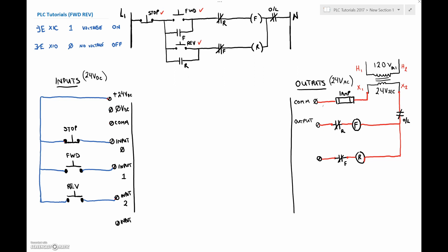I've made a list of all my inputs and outputs. My output for the forward contactor is output number two, and the one hooked up to the reverse contactor is output number three. Over here I had input zero, input number one, and input number two. I've got output zero and one prior to this — I just haven't drawn them in. Then output two and three are the ones I'm making use of here. For the open loop, I'm not having a contact from the contactor going back as an input, and I'm not making use of the overload as an input either.